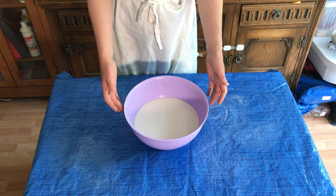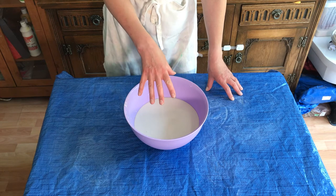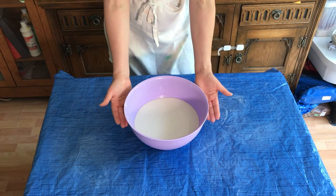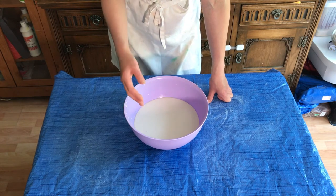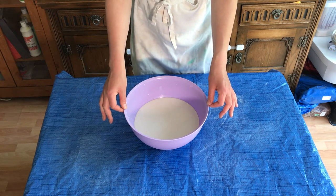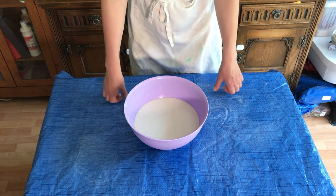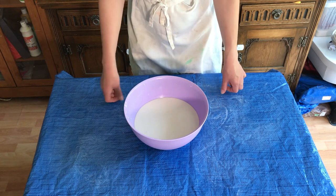In terms of choosing a container to make a mould with, there are a couple of things to know. If the container opening is narrower than the body of the basin, you're not going to get your plaster mould out — it's going to get stuck. I'd also recommend using a plastic pot with a bit of flex. It's got to be quite firm but with a bit of give, because it's much easier to get your mould out — you can wiggle it a little and make the mould pop out.